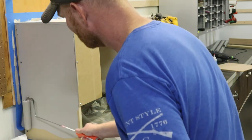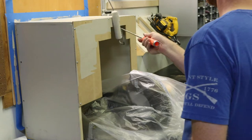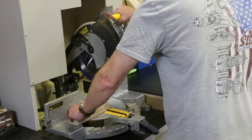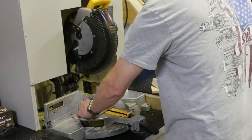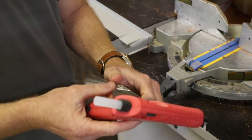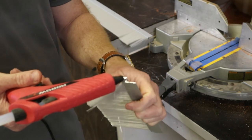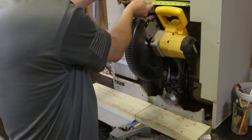I've got this gray enamel and I'm going to put it on the sides, front, and top. I didn't want to get paint all over my saw, so I just put a trash bag over it to protect it. A little bit of paint, a little bit of tape, and we're done with this part. Now I've hooked up my dust collector to the bottom fitting. I made several cuts and didn't like the amount of dust still coming out of the cabinet, so I ordered a three-inch door sweep with the horsehair-looking material. After cutting the sweep it tends to fray, so I'm gooping some hot glue on the ends to keep it in place.